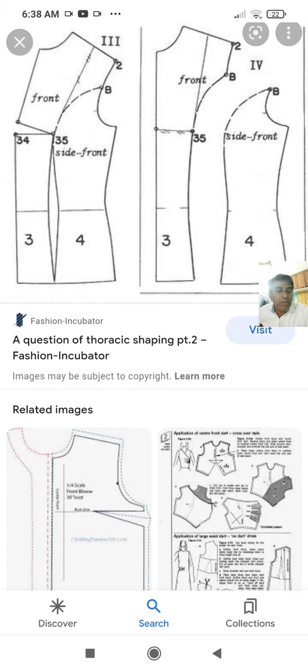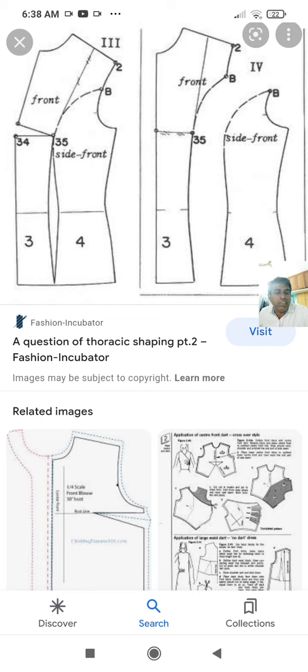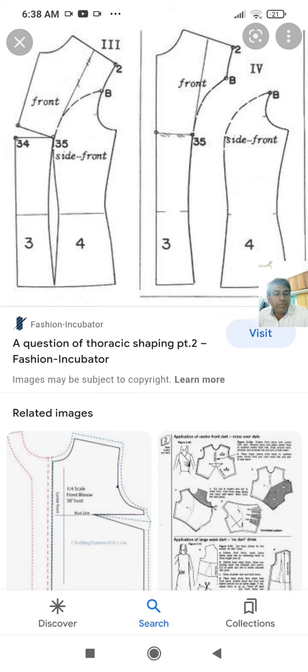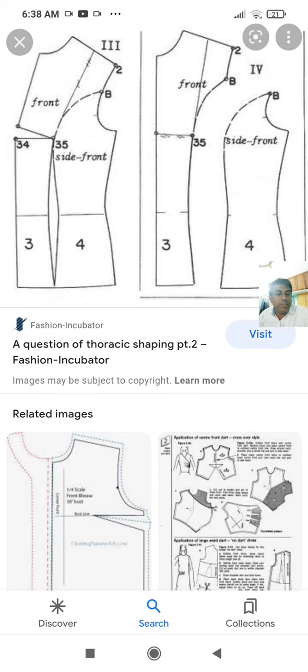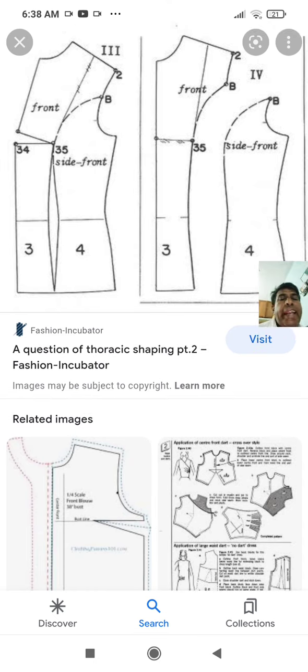Notches and drill marks. Proper positioning of notches and drill marks on markers is necessary so that the notches and drill holes will be placed correctly on cut parts, as they are necessary to guide sewing machine operators so they can accomplish their operation effectively. So the author talks about knife clearance and notches and drill holes, drill marks.